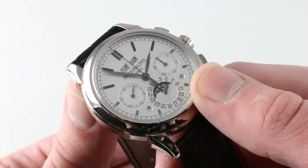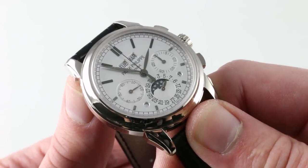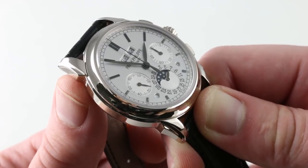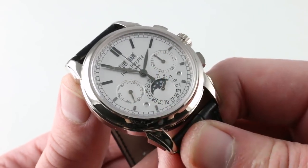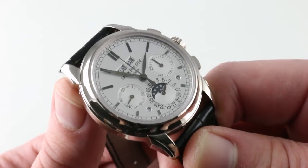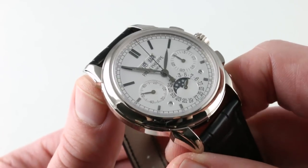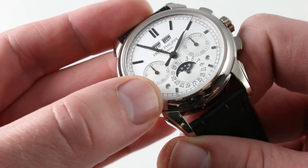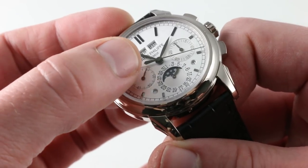There's also an AM/PM aperture for day-night distinction — your danger zone warning for when not to set the calendar. Between 4 and 5, a leap year phase indicator shows which phase of the four-year cycle you are in; remember the leap year is generally the Summer Olympics year. The watch has two different dial finishes: a more richly textured silver metallic on the sub-registers at 9 and 3, and a gentle, almost pebbly opaline — metallic but not satin or directional — covering the rest of the dial. The indices and feuille-style hands at center are executed in a dark oxidized gold alloy. Even the apertures feature a transitional step down from the opaline dial plane to the individual calendar discs.